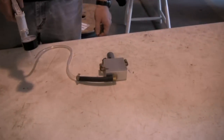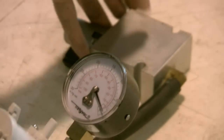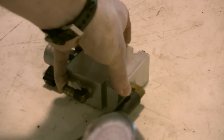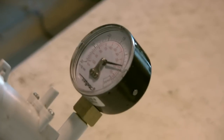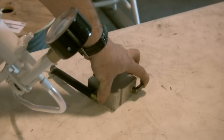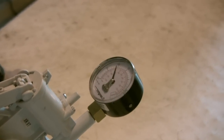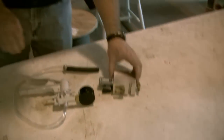We've got a HydroForce valve here. We've got our vacuum gauge here. As we pump, it's not building up any vacuum because we have open ports. So we're going to close one of these ports, pull up some vacuum — up to about 15 — and watch. Our needle is dropping, and the reason is because this valve internally is bypassing and sucking air. So it doesn't take much to overcome this valve. Now if I cover both of these holes, we're at about 20 inches and it's holding. As I let off that hole, it starts sucking down. That's the port that's supposed to be closed. As you can see, these valves are not tight.